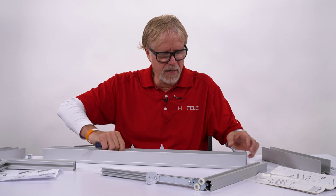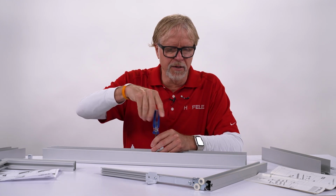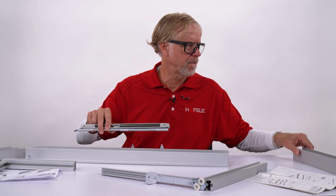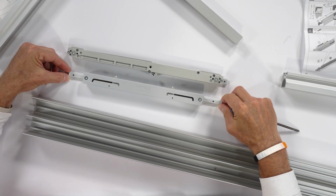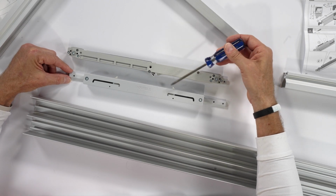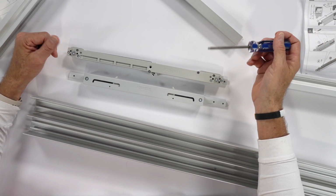It might help to see how it looks different. So in the event you ever had one shipped that was incorrect, you can tell how they look different for the single closer in the left or right direction, or the new closer that works in either direction. As you can see, there's only one actuator on the one that we just reviewed for a left or right soft close. There are two actuators on the center door closer that allow that door to move in either direction and soft close the way that you need it to go for that center door.